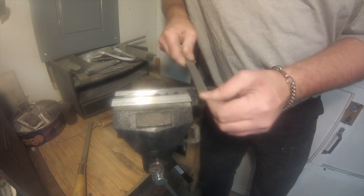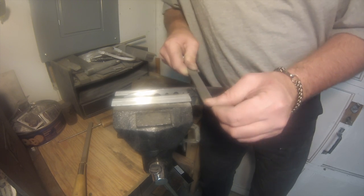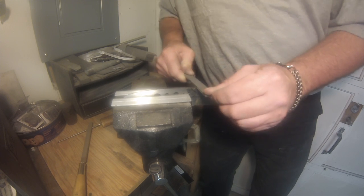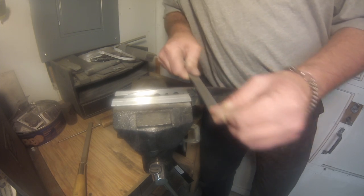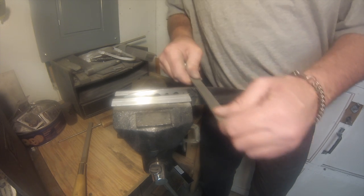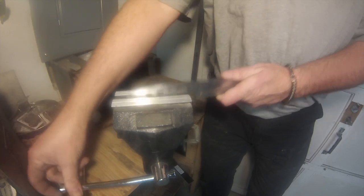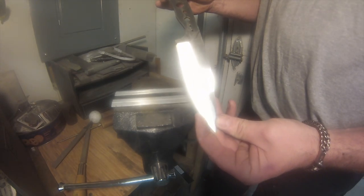It's a good file. You have to be careful you're square and straight every time because you'll break those little tiny teeth off. But really all it is is just a bunch of rows. I think this is 18, maybe, rows of teeth that are filing in a straight line. So that's how you get that jimping. At least that's how I do it. When I started out, I just did it individually with a file. I wouldn't always get them even. So this saves a lot of time and works really well. They're fairly expensive files, but they definitely save time. So I make sure I round that corner really well. So I'll kind of roll it down on the edge and get it really good. So you can see sort of the filing.